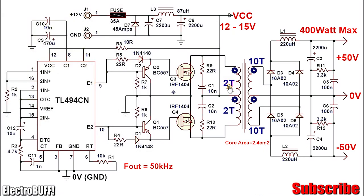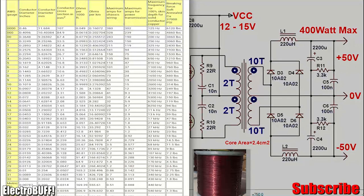The primary winding is 2 turns on each half and the secondary winding is 10 turns on each half. Because the primary will be handling at least 10 amperes at a frequency of 50 kHz, I recommend you use enameled copper wire of AWG gauge 24. Since one strand can handle about 3.5 amperes, I recommend paralleling at least 10 strands to safely handle more than 10 amperes. For the secondary, paralleling about three or four strands should easily handle 10 amperes.